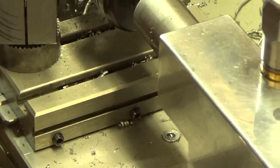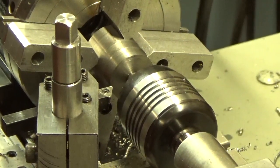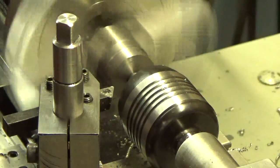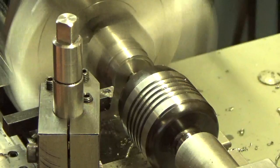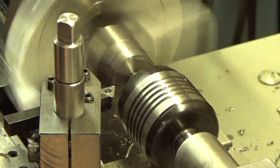The cut is going to be short because I don't want to make a lengthy video, and the feed rate is not very fast. I'm going to put just some WD-40 on the work — not cutting oil, just WD-40. I'm going to dial in and we're going to start off taking 40 thousandths off the diameter to begin with, and see how that goes.